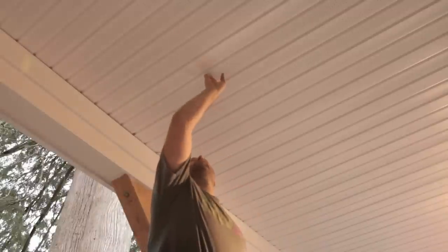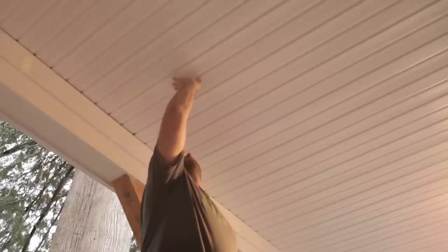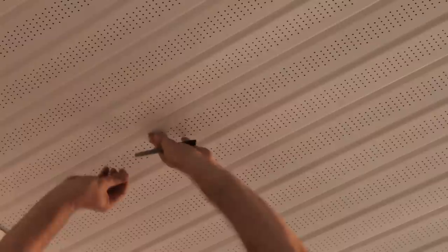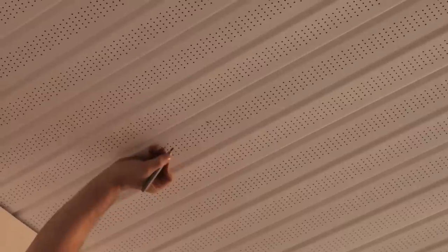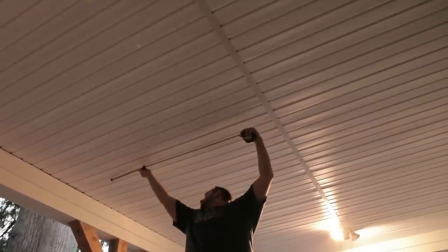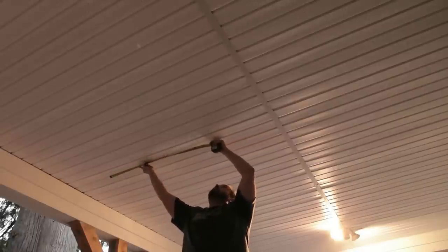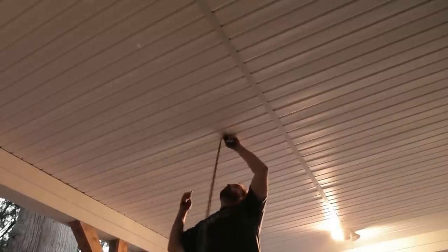With space to work I went ahead and tried to figure out where my actual rafters were located. I did add extra backing into the carport when it was built, but it was still pretty difficult to find where the rafters were. I tried poking at it and using a light to peer through the soffit. In the end what really worked was using a nail to just poke through and find the rough spots, then mark where I wanted to actually drill my holes. I then measured the width of the canoe and transferred that measurement back to the ceiling, repeating the process to find the nearest stud.